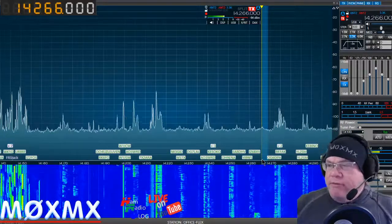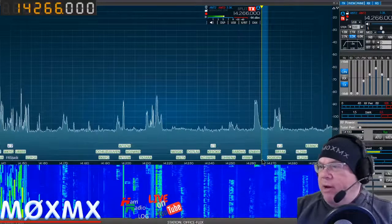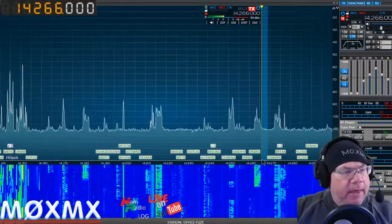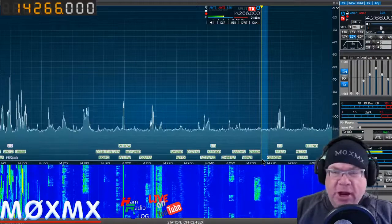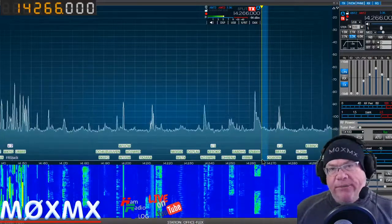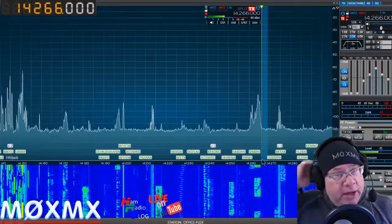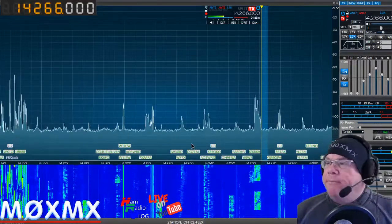So I don't do top band, Lee. Lee's question was, what aerial am I using for top band? I don't do 160 meters, mate. I go to 80 meters and I use the loaded dipole, 40 and 80 meters. It's fairly short in length, only 20 meters long, but it's got loading coils that get me on 80 meters with a little bit of help from the ATU.